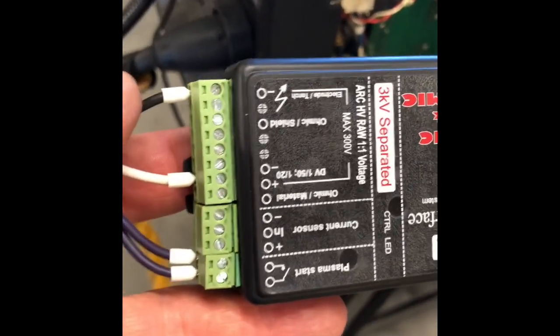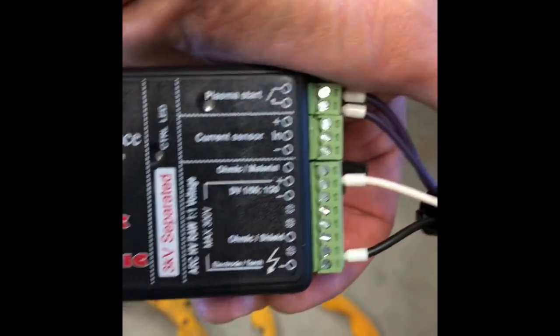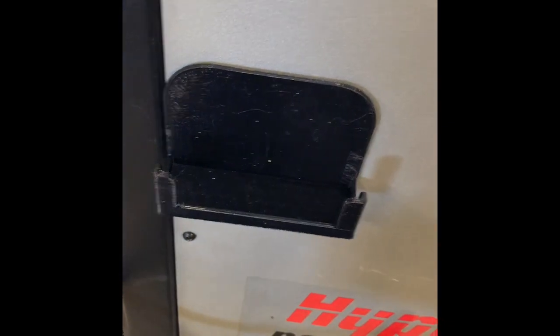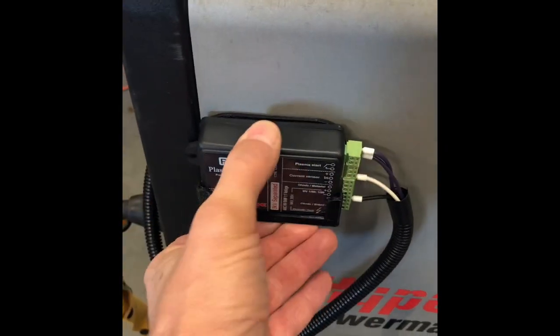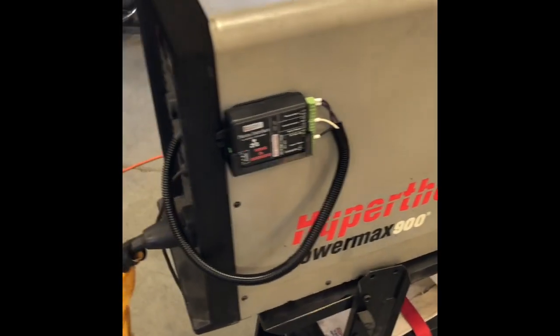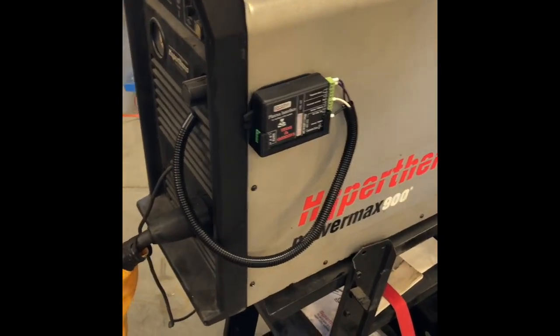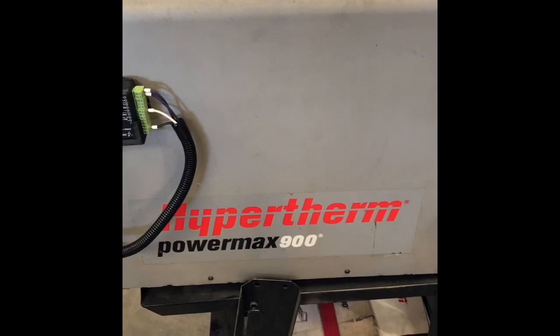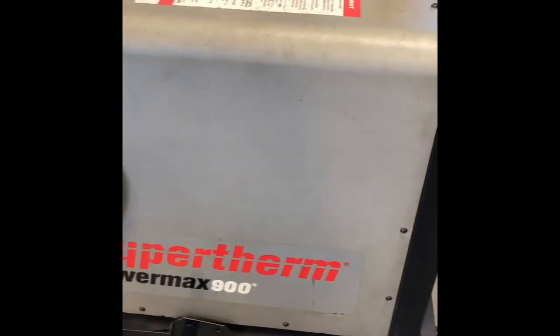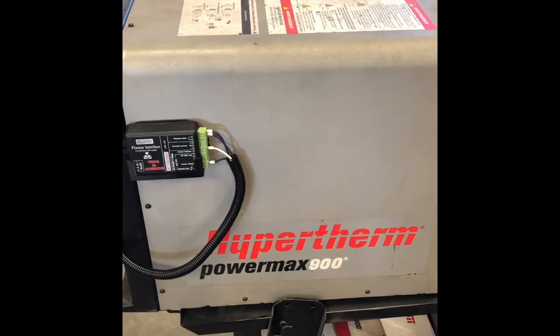And then connected them to the controller. In efforts to be as non-invasive as possible to my machine, I brought the wires just right out through the grate there, put them in some convoluted tubing. I 3D printed a little carrier for the controller, and I just set it in place — it just slipped in, works good, it'll stay there just fine. And then I just make the connection to my machine. So there you have it: PowerMax 900 interfaced torch height controller. I elected to go this route rather than buying the control board for this machine — you can get one, but they're about $300. And actually this interface was pretty simple. So that's the way I went. Thanks for watching.